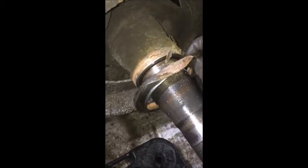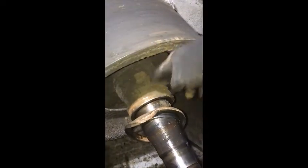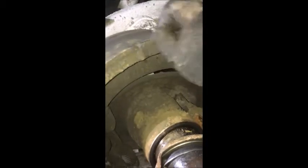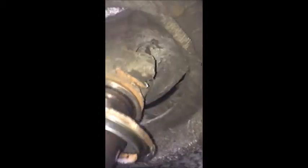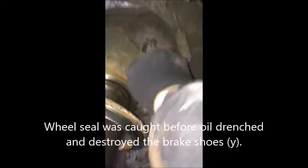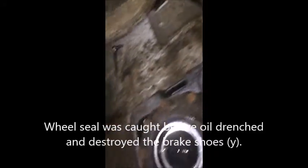This is your spindle off your axle. This is a two-piece seal — so this is out and off. Typically you have to put it on the tractors; you can use a pry bar against your shoe here. Pop around the brake shoes. That's what happens when you don't have a dust guard on it. Wheel speed sensor is still in there surprisingly. We're gonna clean this all up.